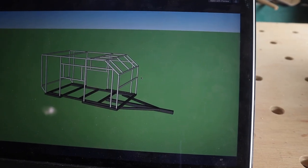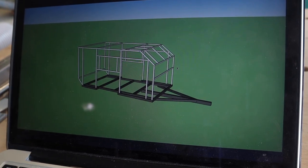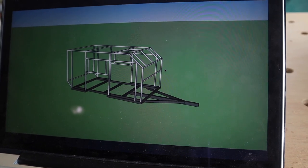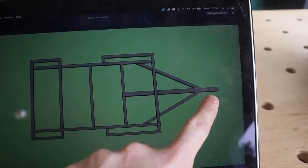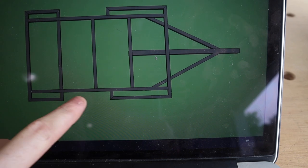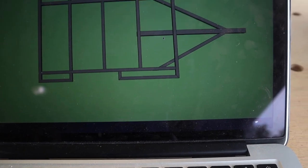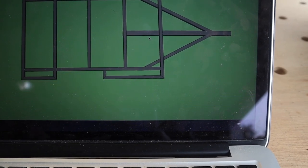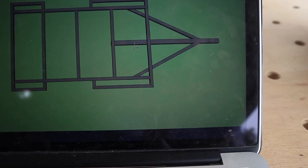That's the whole skeleton. The frame with the skeleton — I'm going to do the actual frame of the box out of one-inch square tube. This is mostly done; there's still some more little braces and stuff I need to add, but this is basically what it's going to look like. And this is what I'm getting started on today — basically just all two-inch tube with three-inch tube for the tongue. These outside pieces I'm not going to add quite yet because I'm waiting for the trailer axle and springs to show up so I can see exactly how high the wheel sits off the ground versus the frame, to make this opening the right size. I'm going to start with this whole inner part and the tongue and leave these pieces off until the axle shows up.